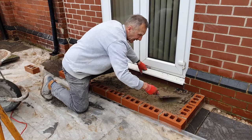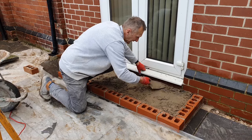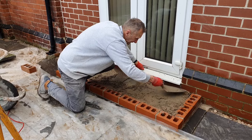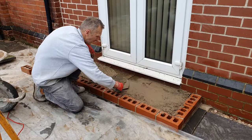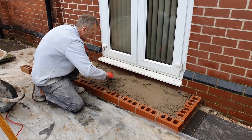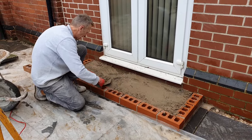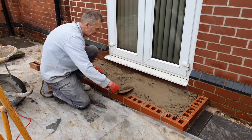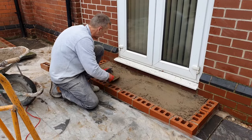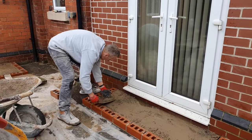And then we're going to put the really nice slabs on top. This is all obviously just the underlay, if you like. And so we'll do that, get that in, and then we'll put a decent set of slabs on top, and then that should look quite nice. So we've got a pattern worked out. Joel's worked out the pattern, so we'll have a look at that. We'll get the nice push slabs on top, but underneath it, anything you've got like old slabs is perfect, or you could concrete, you could use MOT and compact it, but we had these, so these were ideal really.